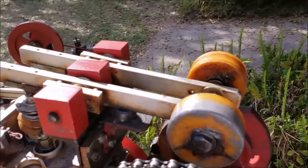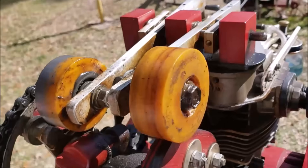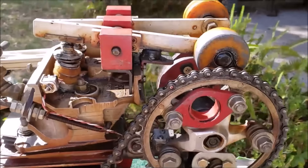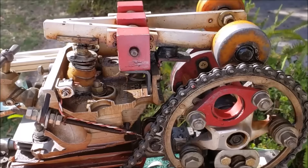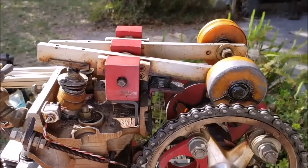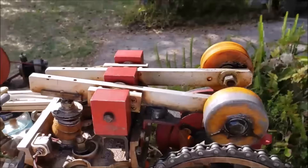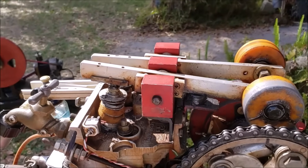And these are roller skate wheels. This is the cam here — you can see it comes up, and this trips the exhaust valve. What's unique is this long duration and the size of the sprocket on the camshaft. The camshaft is running a 5 to 1 ratio to the crankshaft. Unlike conventional engines which are always 2 to 1 — that's how we get the additional strokes. So once it fires, it'll make these additional revolutions freewheeling, because the exhaust valve is held open by this long duration of the camshaft.